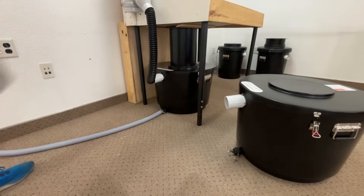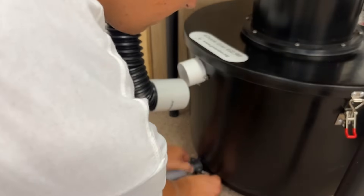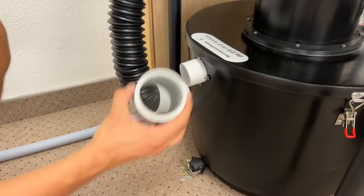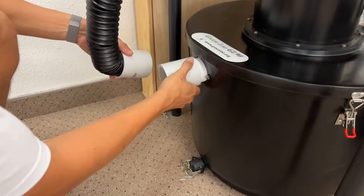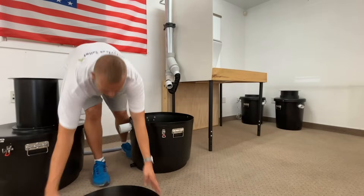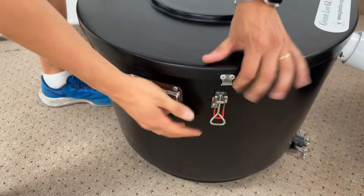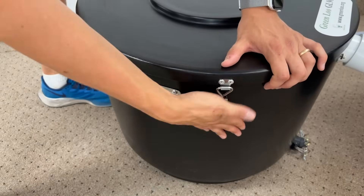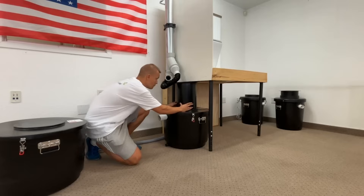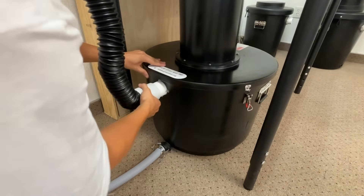Through the hose you can collect excess liquids into a canister or lead them directly into a trench, depending on local regulations and environment. When the composting container has filled up, it's time for service. First undo the vent pipe and the excess liquid hose — the outlet is capped to prevent spills and the vent is sealed with a fly net. Then simply pull out the composting container from underneath the toilet seat and bring in the empty spare container. Switch the lids between the full and empty container; the full container is sealed with latches and left aside for further composting. The empty container is set into use, guided by rails into the correct spot. Finally, reconnect the excess liquid hose and put the vent pipe back.